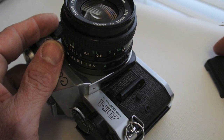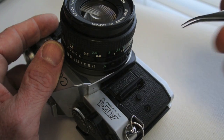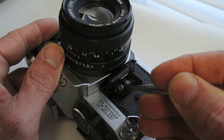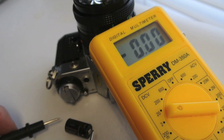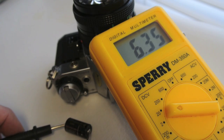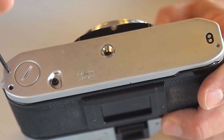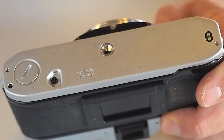The first thing to do when a Canon A Series camera does not release is to remove the 6-volt battery and check with something other than the onboard battery check button. A battery tester or a multimeter will do this. An alkaline battery needs to read at least 6 volts; a silver or lithium battery needs to read at least 5.9. If the battery voltage is low, try a new battery to correct the release issue.